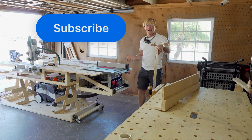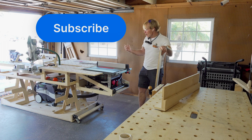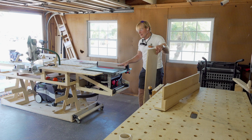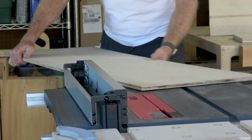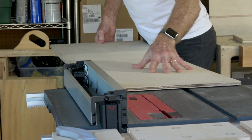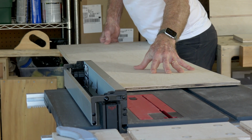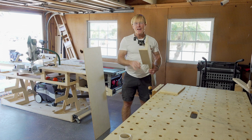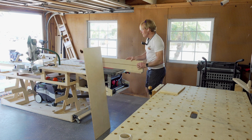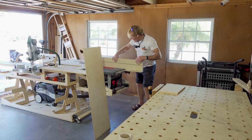On the infeed side, really any table saw, a little one like this or even a big shop saw, we're limited to about 1 foot on the infeed side. With the material being longer, it's a lot easier to have it tip down and also get away from the fence. And that's where this additional piece comes in. Just like before, I'll attach it to the saw.